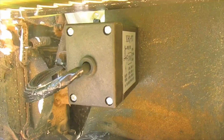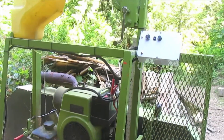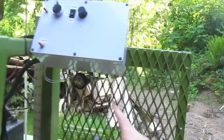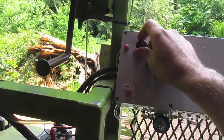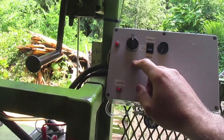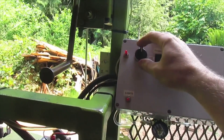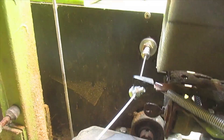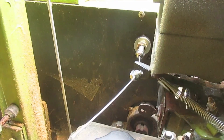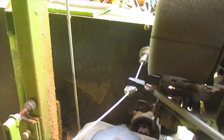I got this all wired up and ran all the wire through a nice little shielded wire loom. I've got the water solenoid wired into the switch down here. This is the main switch — it won't do anything if you bump it; it won't throttle the motor up automatically until you bring this toggle up, which arms the system. Once I turn this toggle switch it will throttle it up. Now it turns on the blade lube — the blade lube comes out down there. As soon as I turn this off it throttles back.